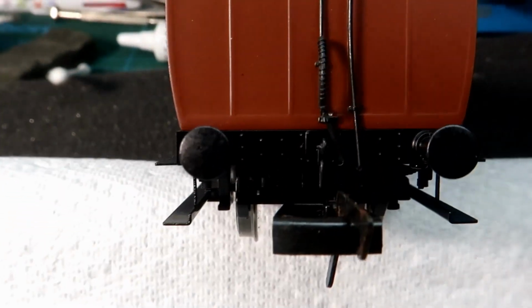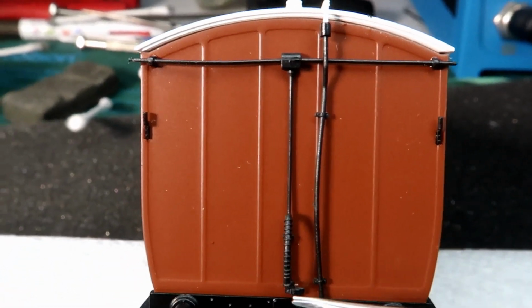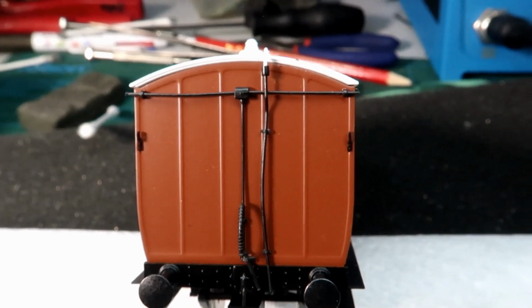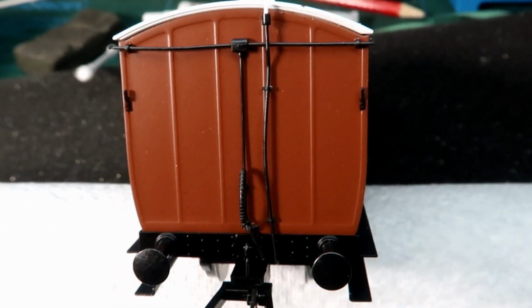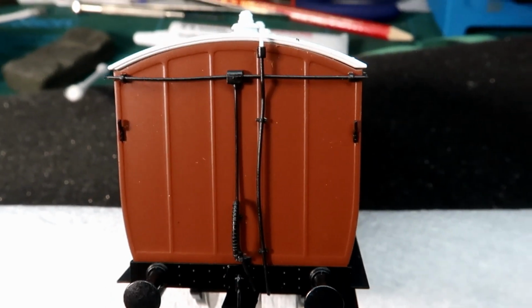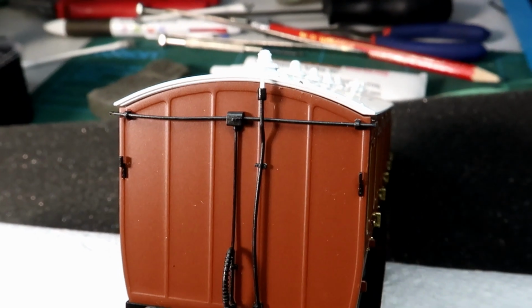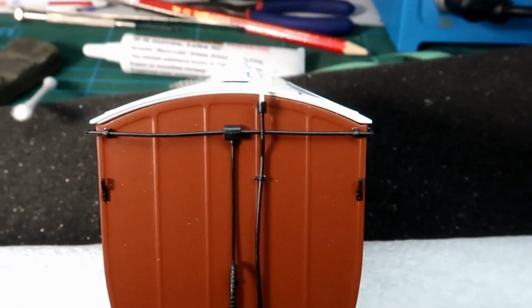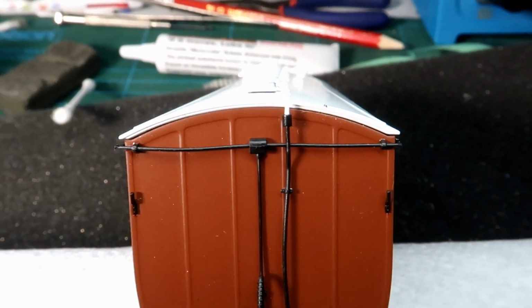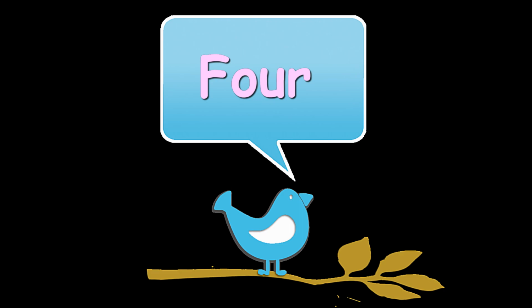At the back here, we've got passenger communication equipment. That's what this is. Pull the chain and the vacuum cylinder gets discharged to atmosphere on one side, applying the brakes. So, not really a niggle, that's just how these coaches work, but if you want to make sure they're looking perfect, then just check that and put the little cup into the peg. Easy, eh?